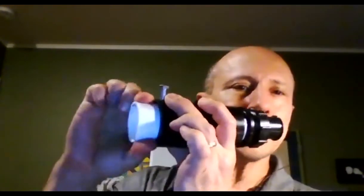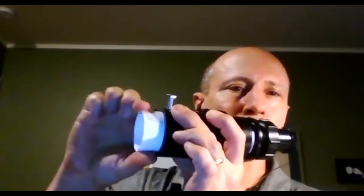Okay. Now on most telescopes, you'll have a focuser that kind of sits right here by the eyepiece, and you turn a knob and the eyepiece moves in and out. Okay, just like you're moving the lens in and out over on the wall. But these are so small and these fittings aren't so good that I decided the best way to do this was to use that screw, loosen up the screw, and you're gonna focus the telescope by turning and sliding the objective lens in its white coupler, okay?